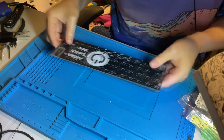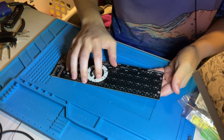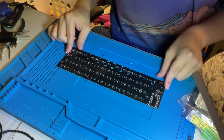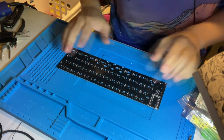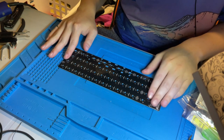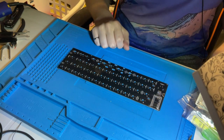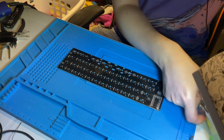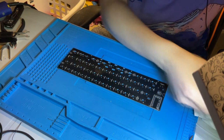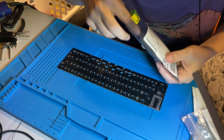Here's the solder PCB. This one will look a bit different from the one you'll get because the logo sizing will be changed. On the back is where we'll mainly be focusing — this is where the difference really resides between the soldered and hot swap versions. The soldered version does not have pre-soldered diodes. You will get a small package filled with more than enough diodes to build the soldered PCB.